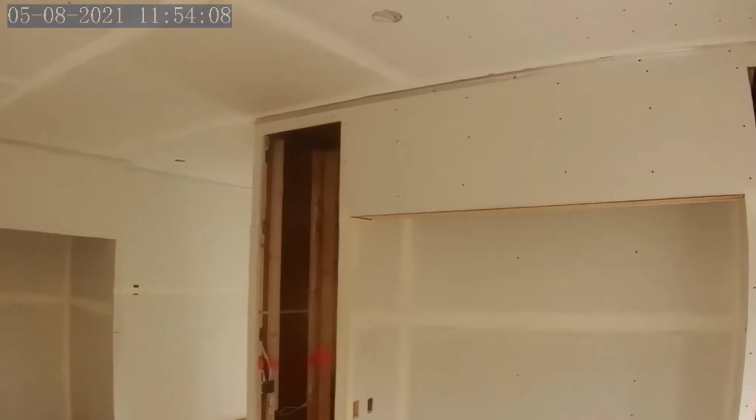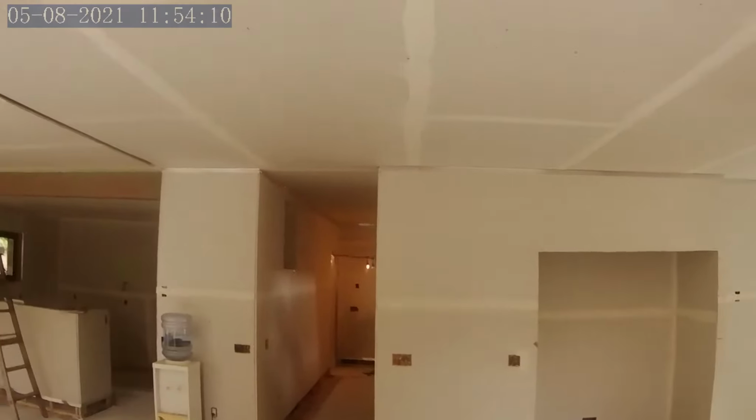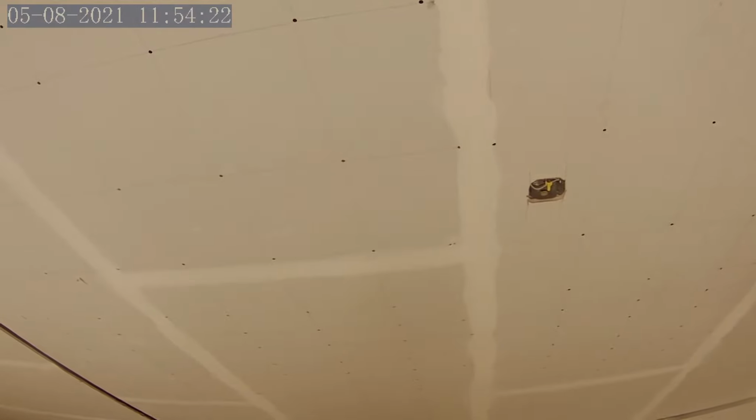The ceiling took them, they figured about three times the normal time. So if you remember from past videos, there's a lot of hot water space conditioning pipes up there on a 6-inch spacing. And the requirements for the system are that we screw it between every row of pipe, every 12 inches down the row.